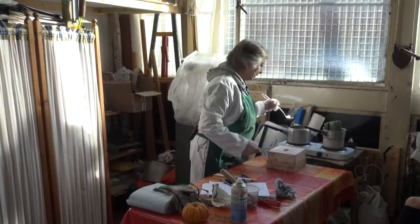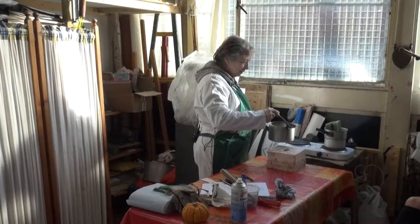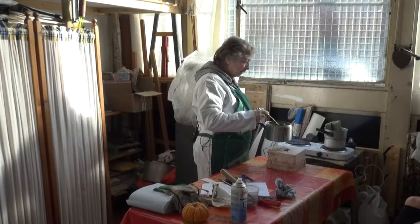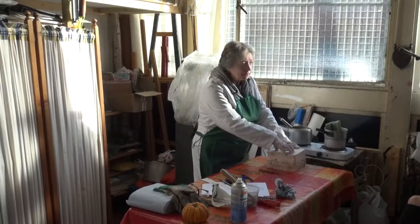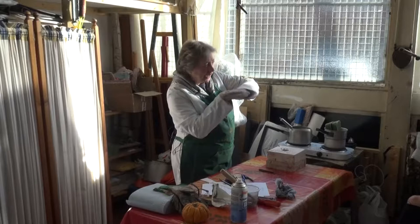There are different techniques you can use. This first one will be to fill the whole mould and let it stand for 10, maybe 15, even 20 minutes, by which time it will start to thicken, and then you empty out what's left that's molten and leave it a little bit longer, then take it out. Some of it will probably come out of the side, but only of the rubber mould bit — this part is heavy and big enough, and shouldn't seep out because the way you create the jacket, there's no gap between the two layers.